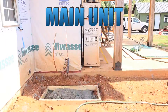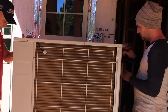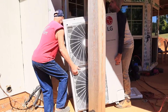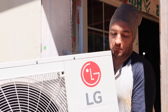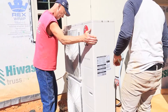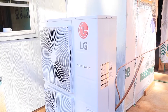You set the exterior unit on a pad and anchor it down to the ground. It uses its own power, so there's only one main power hookup — the exterior unit — and then all the other units are wired to that. One thing to know: when we were hooking up the final unit, the system was still energized and I forgot, so I cut right through the cable and it popped a 10-amp fuse on the exterior unit. There is a fuse on there, very close to where the power leads connect — not hard to miss.